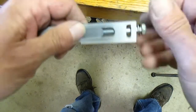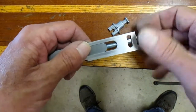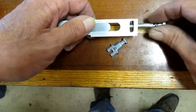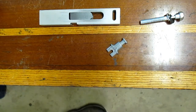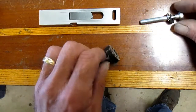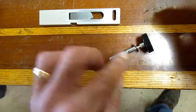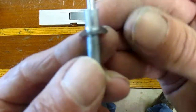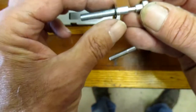Now we can unscrew this. Keep everything in order — there's the screw; you can just lay the whole works out like that. Then I'm going to grab the new adjustment screw. Right here there are two washers on this: a flat washer that gets set aside because we have one with the new unit, and right here is the spring washer. There's a direction to that — the bends of that go in towards the bar.